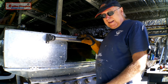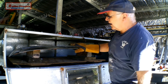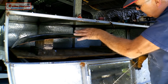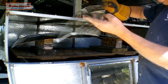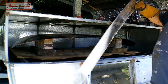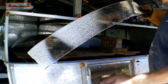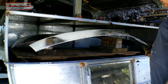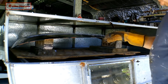I've just done my test, heating the Honda factory rear window in the oven and moulding on the glass itself. The glass didn't break, didn't explode, didn't crack, didn't burn, didn't smoke. The acrylic moulded with no worries. The Lexan test piece moulded too, but it's crazed because it was just a scrap offcut and I hadn't pre-dried it — just another reminder of what happens if you don't pre-dry Lexan. I'm going to have some lunch and then have a go at moulding a window directly in the oven.